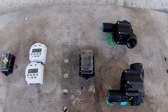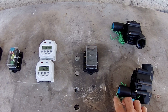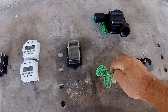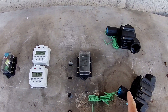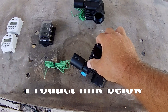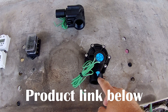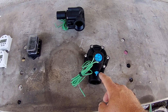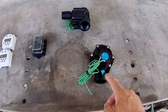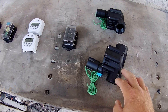After that we've got another fuse box. It seems a bit like overkill but I'm going to put two sets of fuses in so that if the valve wires join together and short out, the timers are protected from the valves and vice versa. Finally, these are 12-volt valves — quite a rare beast. I ordered these direct from China; they normally come in 24-volt AC house power, but we're doing this off-grid powered by 12-volt DC solar power. They're readily available from somewhere like AliExpress and not overly expensive.